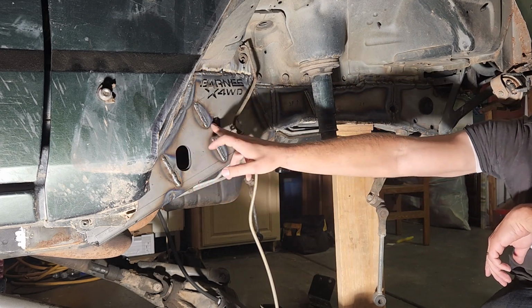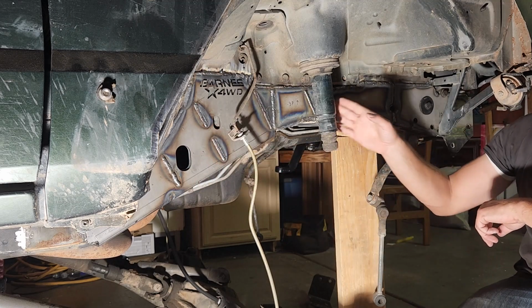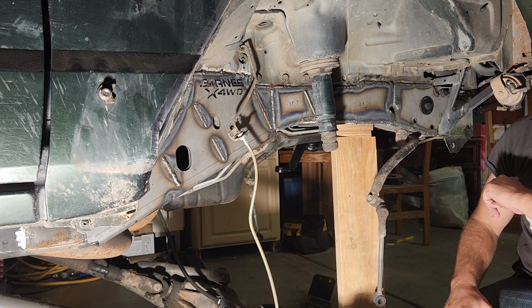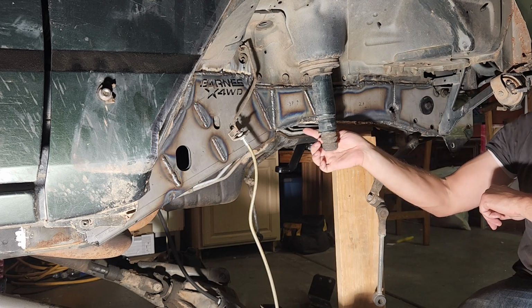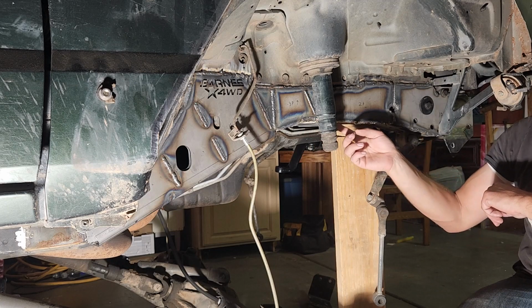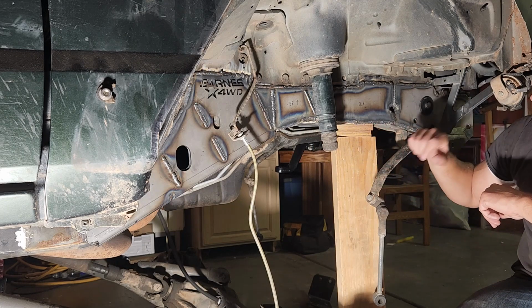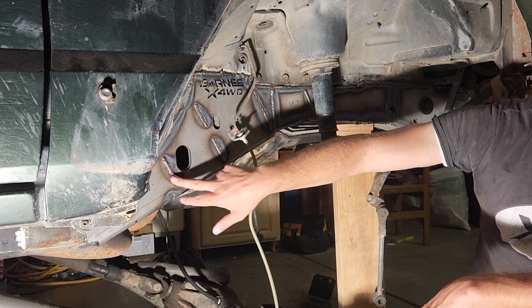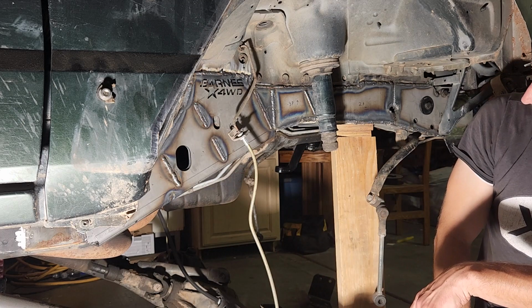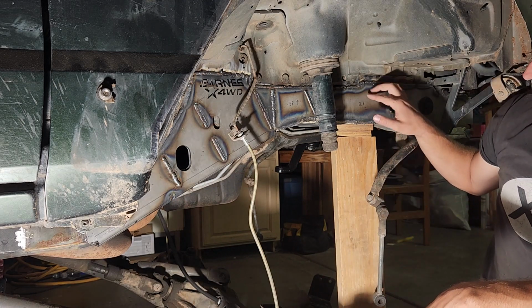And then I welded in this plate because where it fits, you can tell exactly where it goes. Get this hole lined up, get that hole lined up, and then fitting these two in between is kind of the hardest part. This seam along the edge on the bottom is probably the hardest weld. You have a lot to fill in right here. I need to clean up some of the welds, just kind of make them a little bit flatter, prettier. And then I'm going to paint the whole thing.